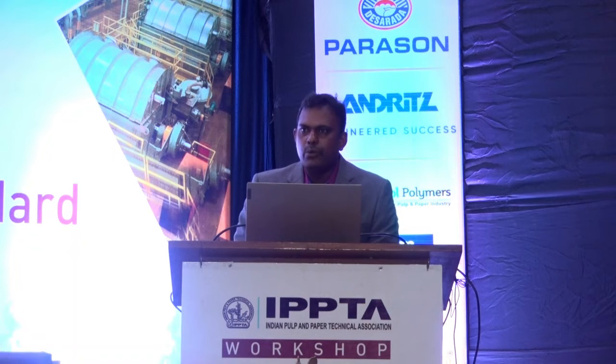In earlier days, we used to have a screw conveyor after this press for diluting the pulp from 30% to 12% or 7% or however much you want. But now we have removed this screw conveyor. Instead, we have created a new equipment called the vertical dilution device. Here there is no energy required. It is like a normal chute with some dilution. That is also working well, and in India many recent mills are having this type of vertical dilution device. So now the screw conveyor is not required for diluting the pulp.